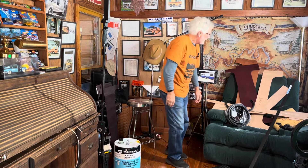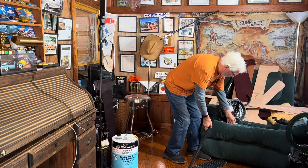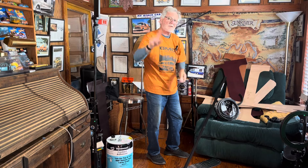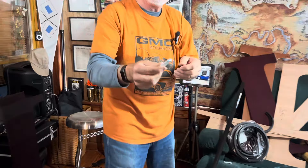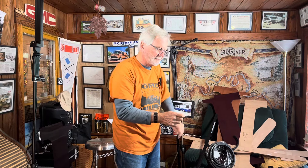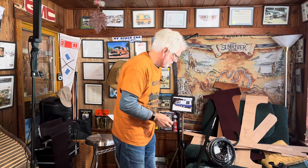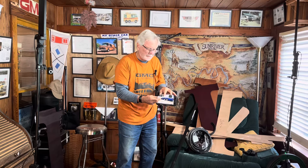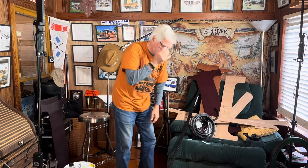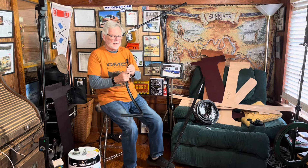For the divider bar, I found it at Home Depot — $3.58 for a 96-inch stick of this stuff, and that's all we're going to need. How do you cut it? You take your handy dandy Olfa knife, slit it once and it'll snap, slit the back again and it snaps again — piece of cake. I covered it, shot some glue on the face, cut it a little bit wide, and then stuffed it into the H molds, which made a nice, real nice trim.